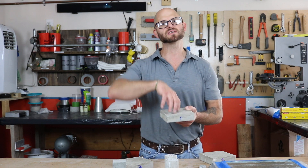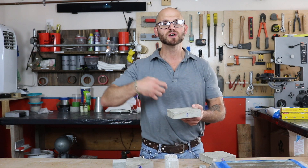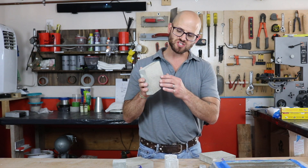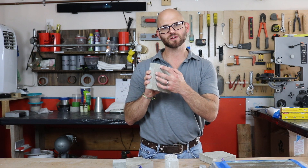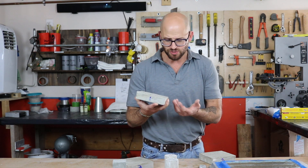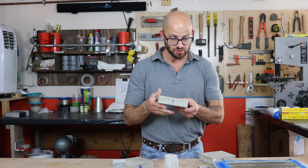What those members end up doing is restraining the bottom of the concrete as the top wants to move because of that evaporation. Normally, what happens is you get spider cracking or crazing at the surface — it almost looks like a city map. And as you can see with this Quikrete 1106, I've got three samples — we do three samples for repetition.